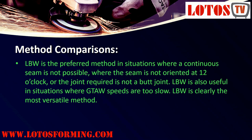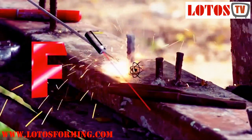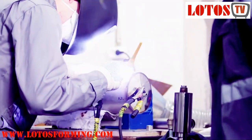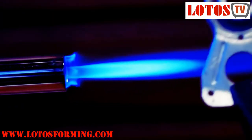The decision to use GTAW is driven by a few key points. First, the weld seam must be continuous and at the 12 o'clock orientation. If the limited speed capability is acceptable and equipment cost is a concern, then GTAW is generally the right choice. It is important to note that a GTAW mill can be upgraded to LBW without too much trouble. GTAW can be considered an intermediate step before transitioning to LBW. It's also possible to set up the mill so that it can be changed back and forth between GTAW and LBW.